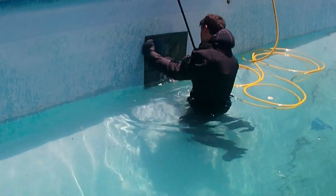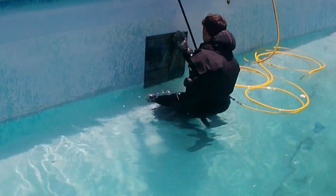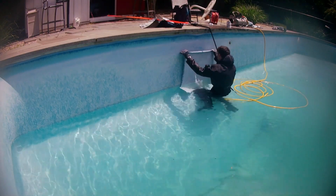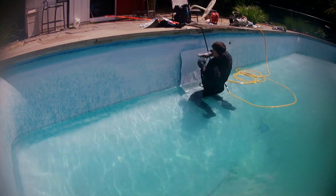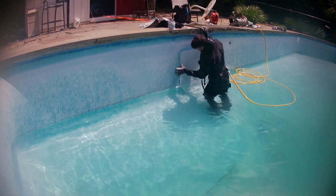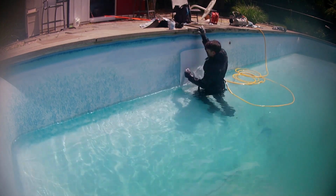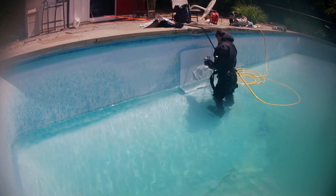By attaching the top side of the tear with the lower, you not only create support for the liner, but you are filling the gap of the tear, and the support of the second larger patch will reinforce the first one, and both of them will be able to hold the liner safe until the new one arrives. Since the first patches will be under the final, it doesn't really matter what color they are. The final patch will cover them. The second patch will have to be one piece if possible, so it looks better and supports all the area around the first patches.